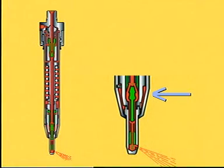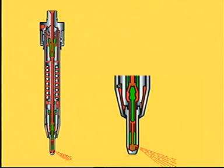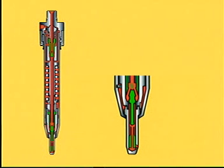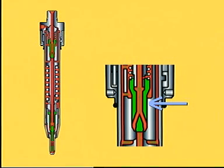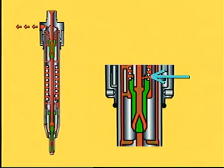First, the spindle closes. The oil will stop flowing the moment the cutoff slide has covered the nozzle holes. This well-defined closing of the fuel valve will minimize the fouling of the components in the combustion space. Hereafter, the slide on the non-return valve moves downwards and uncovers the circulating bore.